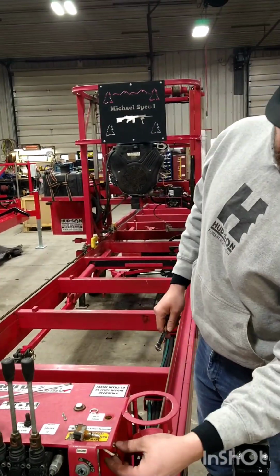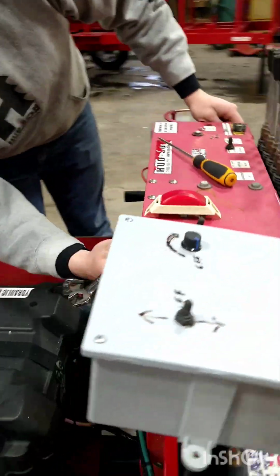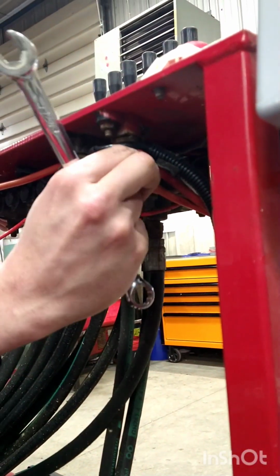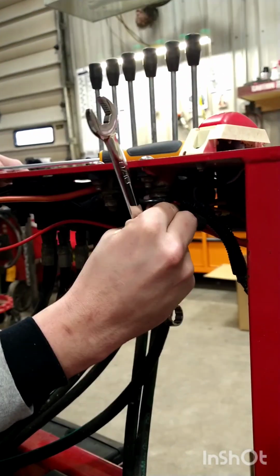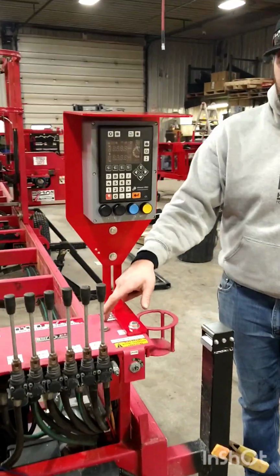After you get everything disassembled up here, go ahead and loosen the nut on the post for your positive terminal and pull the wire out of the top of the hydraulic valve. Install the Setworks box onto the bracket before or after installing the foot onto the operator station.